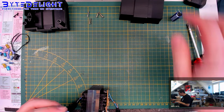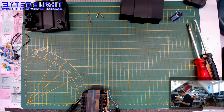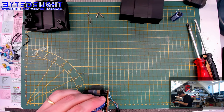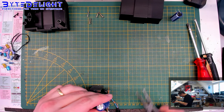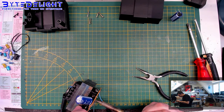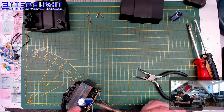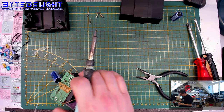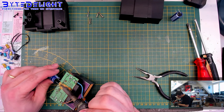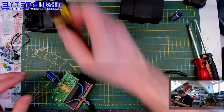This is also really important. If you don't do this, then there's a big chance that the efficiency of the transformer will go down by a lot. And also the question is if we still get about 9 volts on the output. And of course, because this is a transformer, not a DC-DC converter or a switching power supply, this will not be exactly 9 volts at the output. So it's about 11 volts by default when you're not putting any load on it. So that's normal. If you measure 11 volts on the output of a ZX power supply, really, that's normal, don't worry. But if you put it on the load, it will go down to about 10 volts, something like that.